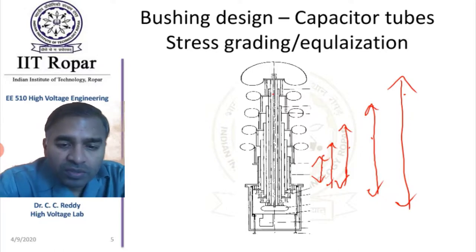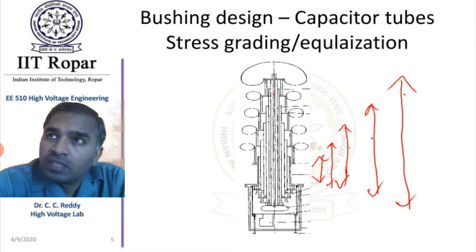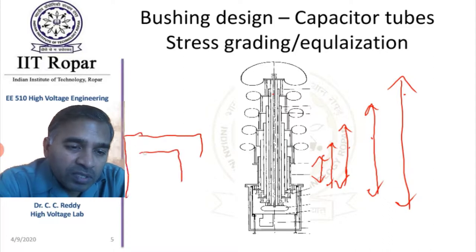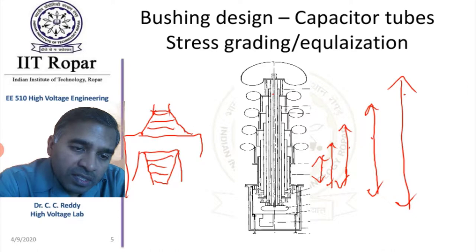There are five capacitors. This is similar to what was studied regarding transformer winding in this semester — how the transformer winding is trapezoidal in nature in high voltage transformer construction. The outer layers have decreasing winding lengths, because in order to maintain equal stress among the layers, the actual profile requires lengths to logarithmically decrease from the central core.